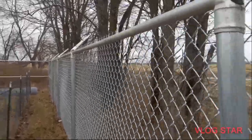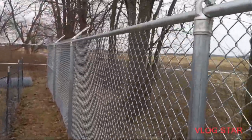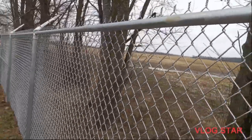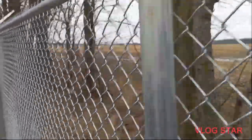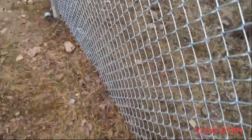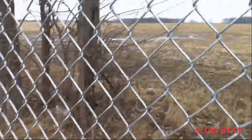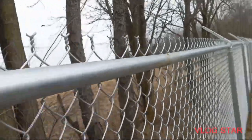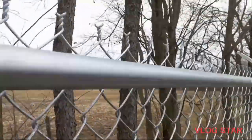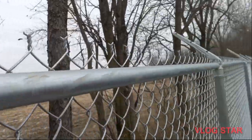On this last 30 feet there's a big hump in the top rail - I went through and cut that down a little bit. We're gonna have to do a little bit of trenching. The chain link fabric's already started to trench itself for me - it was telling me it wanted to go down, so I don't have much trenching to do there. Through here maybe about an inch or so and it'll be good.